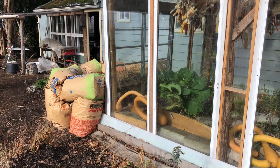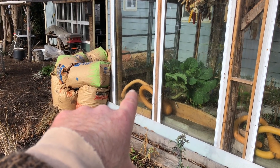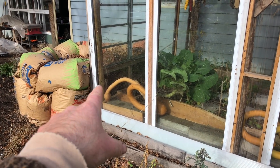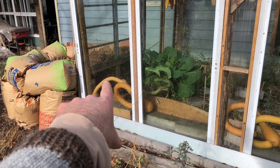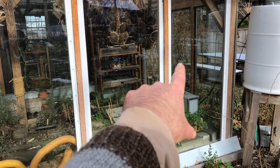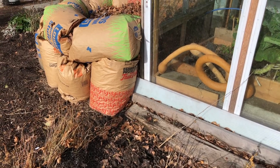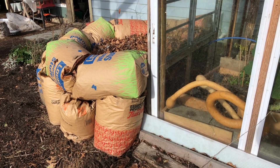When I built this structure, I documented how here on the southwest corner I integrated — very simply — a half-inch hardware cloth mesh. It's a metal mesh that allows really amazingly good ventilation during the summer months, with passive airflow from there all the way through to the door, which is also replaced with mesh. There's tons of good ventilation even on a 90-degree day. As we get to the cold time of year, it serves as an opportunity to set up a thermally productive compost system on the outside that can release some of that heat into the greenhouse.